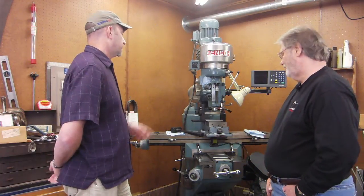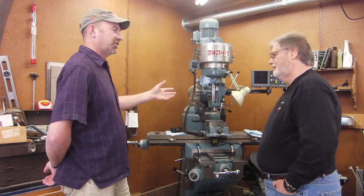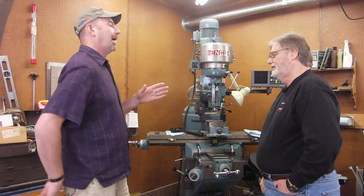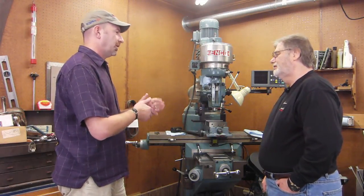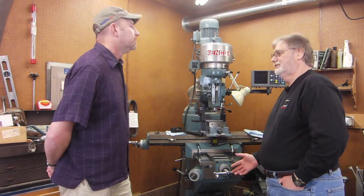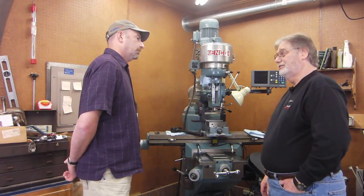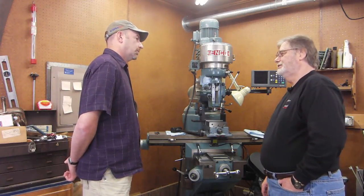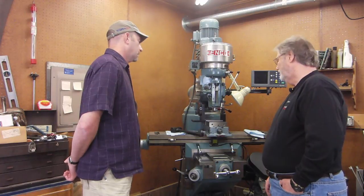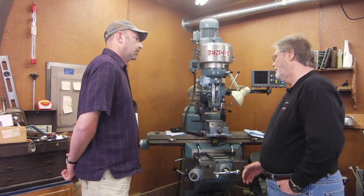So. And then since I know absolutely nothing, I never even took a high school machine shop class, this is kind of interesting to me too. Do feed rates and all these variables depend on how big the cut's going to be, how deep it's going to be? You have to alter all these variables to suit the... It's really the material, how hard it is, or surface speed, and the cutter, whether it's carbide or high-speed steel or something else, and how many teeth are on each of the cutters, the diameter of the cutters, all that figures into it.